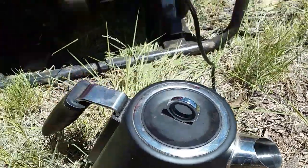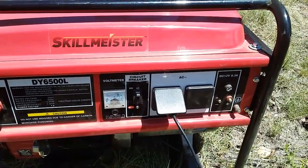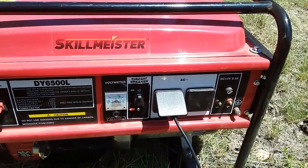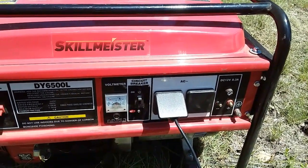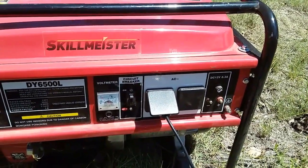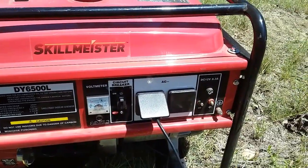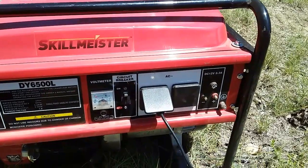The jug is boiled. We saw the circuit breaker switched on and off several times, and we heard a very, very specific difference in tone, in the form of load on the petrol engine turning the shaft of the generator. So when current was flowing, when the switch was on, we saw very plainly that the generator shaft had more torque on it, which was very obvious by the sound.